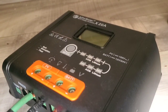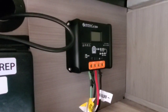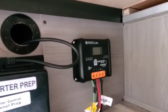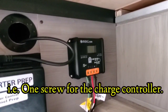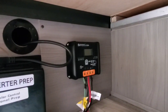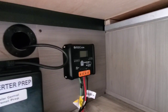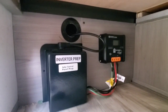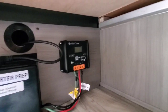After this is up and in place I'm going to put the battery on and then attach a solar panel temporarily on the roof. I got it up there — in hindsight, what I strongly suggest is you put the panel back up behind the charge controller without putting the screws in, attach one screw — I did the bottom left first — that'll give you the position on that backer board. Then take it off and attach the other three screws, because getting those back two screws in took me probably 20 minutes. They put the prep box a little bit more to the right, so you get the controller to the left of the box — that would be a lot better because then you can actually see the readout.